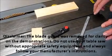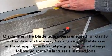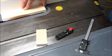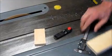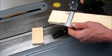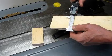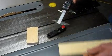The first step in cutting an accurate width is to cut the board a little wider than needed so you know what the fence is set to. Then measure the board with your calipers. Attach your calipers to the miter slot base.